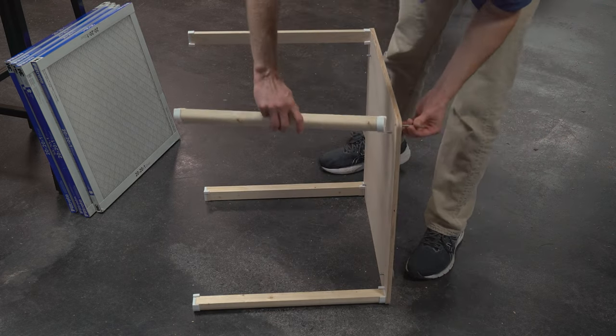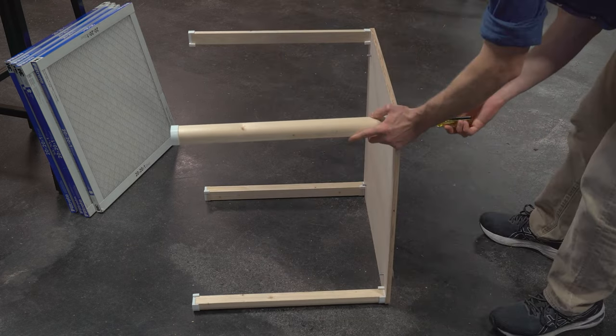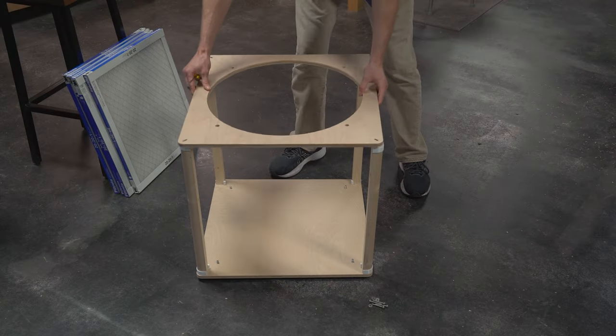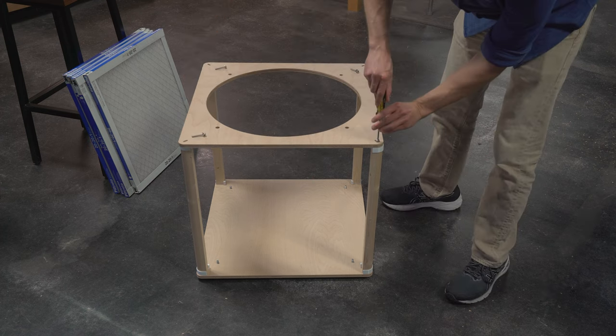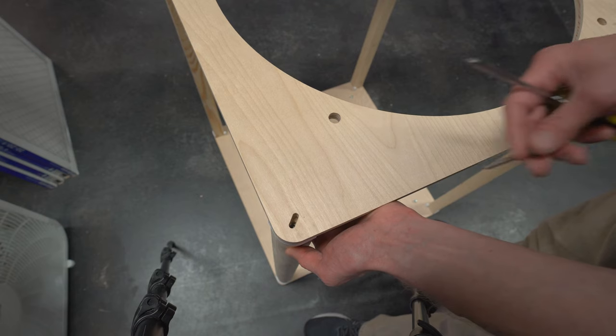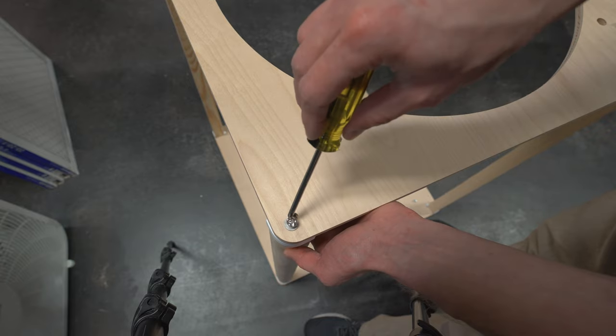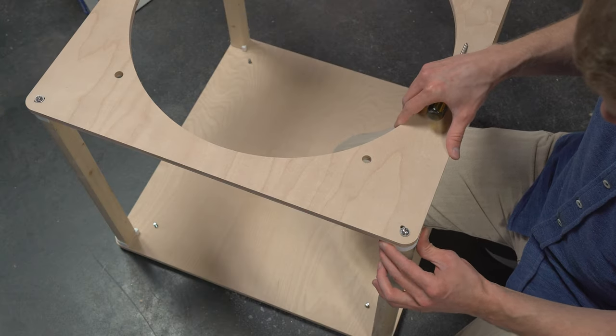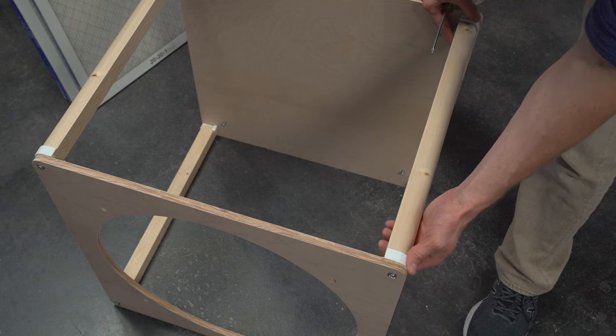The round edge of the leg should be in line with the round edge of the base. Then bring in the top plate. All the sides are the same, so pick any direction. Now run four screws with washers into the top side until tight. The slots in the top and bottom plates allow the leg to shift in and out. This action grips the sides of the filters.